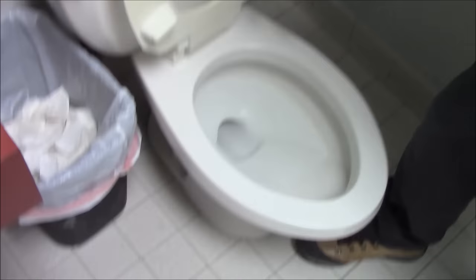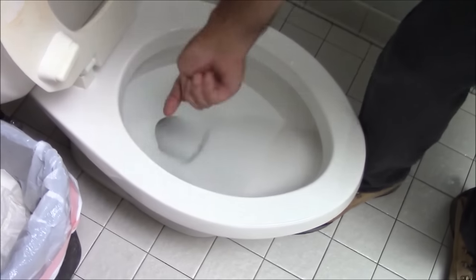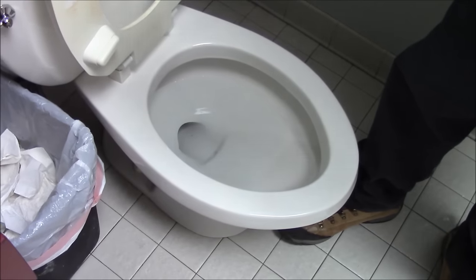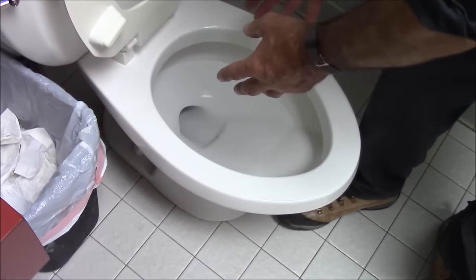What happens many times is it's due not to the drain — it's due to a toilet that's 30 or 40 or more years old. The water, when it goes through the jets from around the rim of the toilet, those jets underneath the rim have all filled with calcium, so they're smaller and they're not transferring water for a downward flow like we'd like.